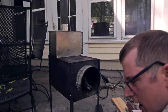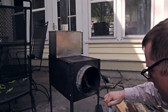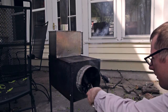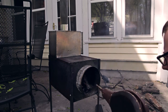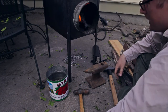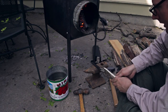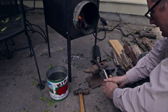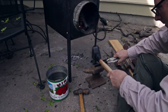I've got a good hot bunch of coals in there at the front, and if my theory is correct, I should be able to put this piece of steel in there and get it hot enough to go ahead and pound it out a bit. I'm just going to try it out here, get those coals real hot. It's been in here a couple of minutes heating and I don't know if this will work or not — I have zero experience doing any of this kind of stuff. The one thing you want to make sure of is that you don't pound the metal unless it's good and hot, and I think we're there. I'm just going to see what happens — if I can flatten out this end a little bit.